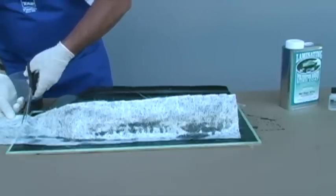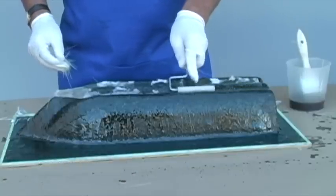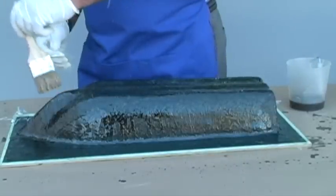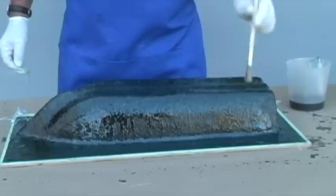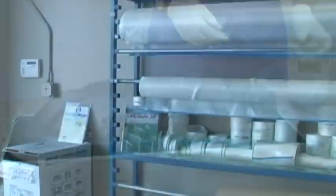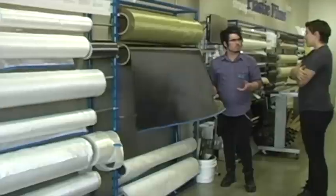Use straight edges around the edge of the mold. Using a mat roller greatly helps lay the mat down and remove bubbles. Apply several layers to give the mold the necessary rigidity. 3 to 6 layers will be adequate for this mold. Some molds may require 6 to 10 layers or even more depending on their size and shape. Note that the mat, selvedge tape, and many more fiberglass fabrics are available in the Tap Plastics stores and at tapplastics.com.